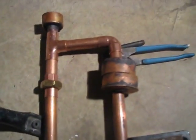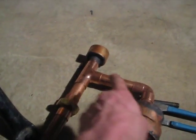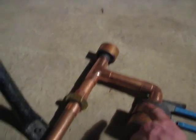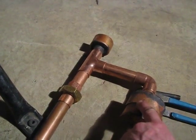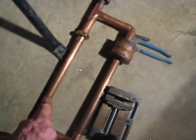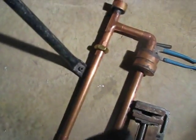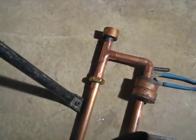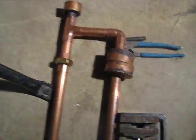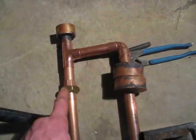What I'm going to do before I get this model going is something different — no more rubber bands and latex. I'm going to do some type of real diaphragm, and then I will do the regenerator over here. The heat will be applied here, and I'm going to try and get some really good measurements. I'm not sure if by upsizing the pipe I also have to upsize these chambers.